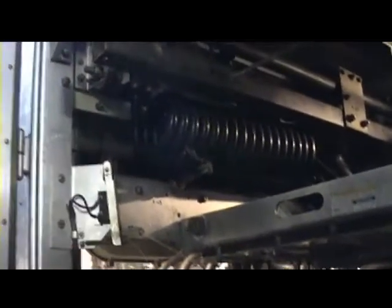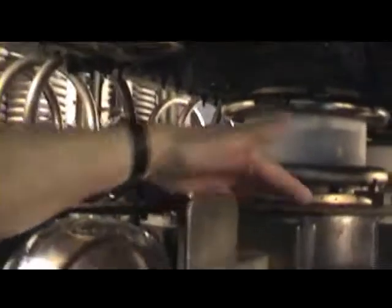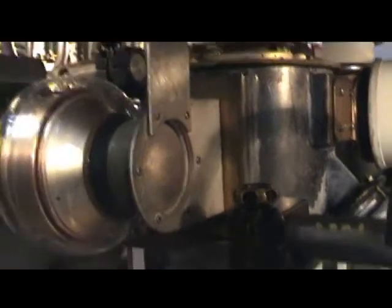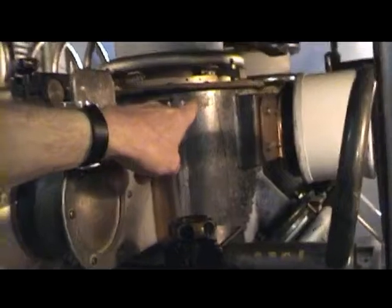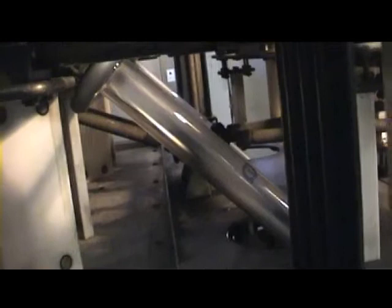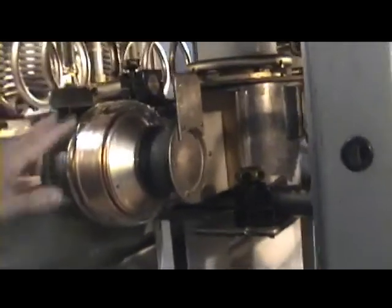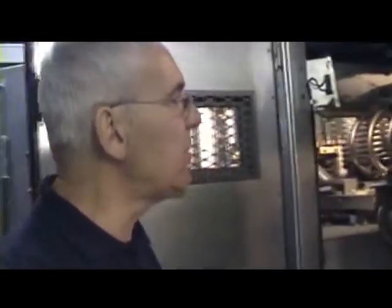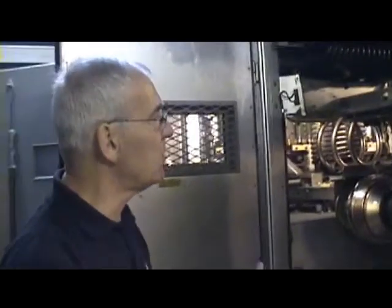The grid is grounded here, and the anode is the boiler in which the anode of the tube is mounted — it's steam cooled. The deionized water comes up through the white pipe into the bottom of the boiler, overflows the weir, and the steam and excess water go off down a glass tube for insulation, taken down the back and then condensed. That's standard vapour cooling — very efficient, because taking water to steam removes a great deal of heat.